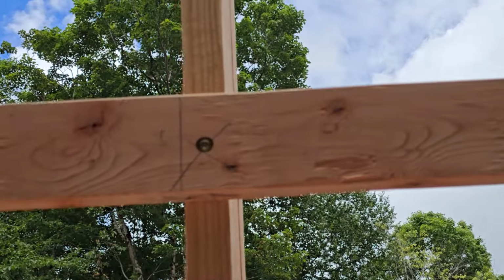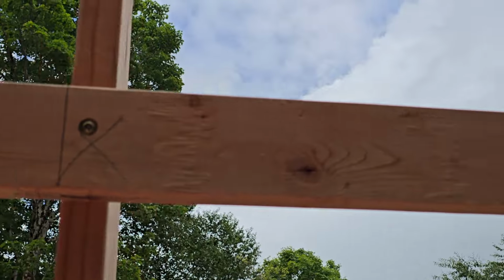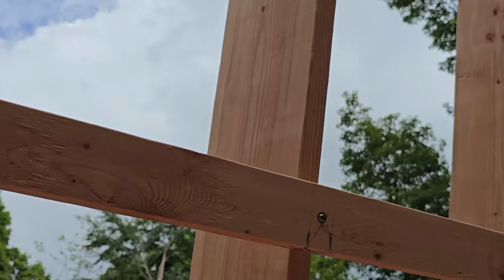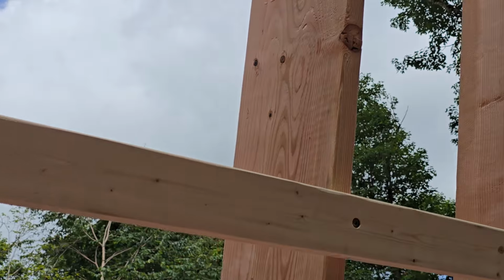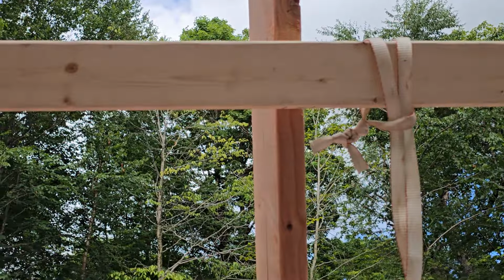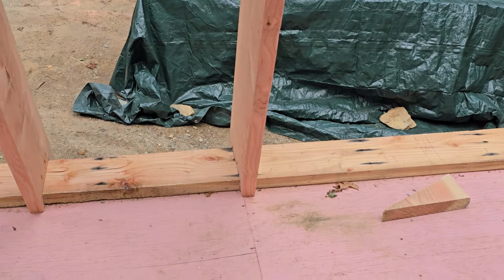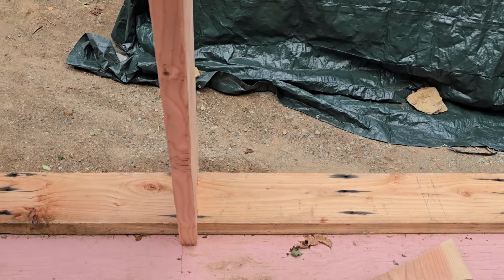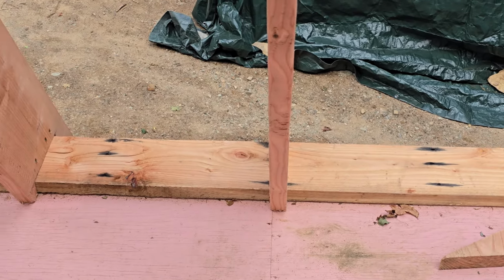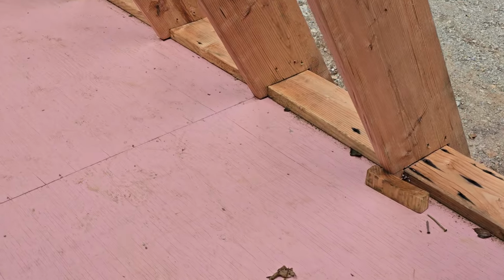So anyway, you'll see these layout marks. Basically, we put those on this wood when it was laying down on a bench, so we set up these layout boards, the idea being now we can keep all these rafters in parallel so that we'll carry it. And we checked, like we hung the plumb bob down recently just to verify we weren't going off layout, because you'd be surprised how many mistakes you can easily make, because we had marks on here for dormers and various things that are going to be built later. Right now all we wanted to do is get these rafters down and locked in.